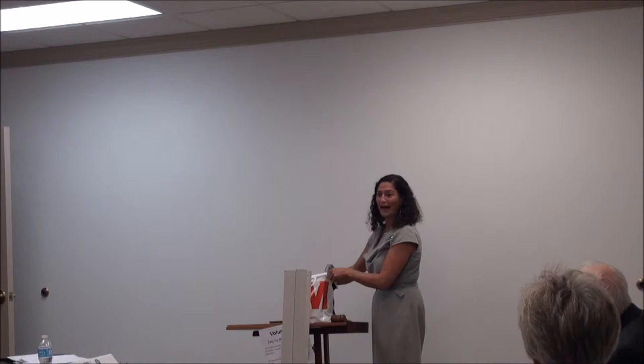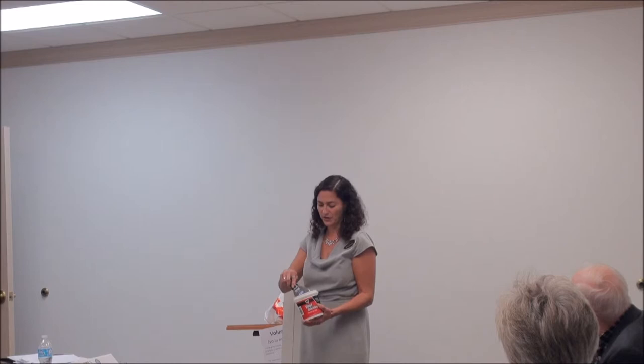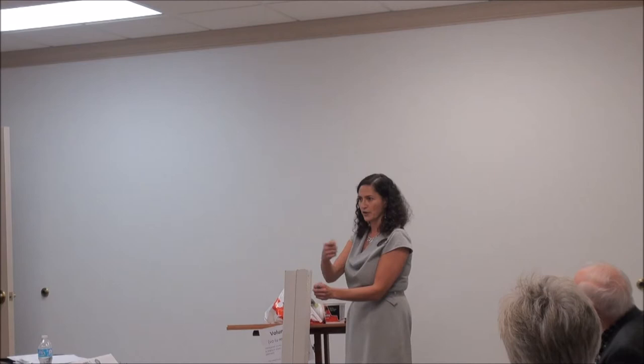There are different materials for spackling, or as Southerners call it, mudding. This is spackle and it comes premixed or in a powder form that you mix with water to get a consistency similar to cake frosting. This is actually how I got into spackling — I used to decorate cakes, so spackling became very easy for me. You mix it up to get the air bubbles out. Usually you'd have a big hawk — a metal square with a handle that sits flat — and you put your spackle onto it and spread it around. That's important because otherwise it'll bubble after it's on the wall and you'll have extra sanding.